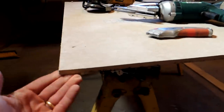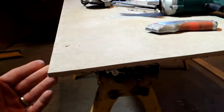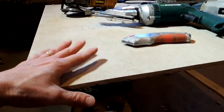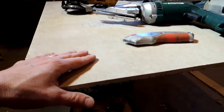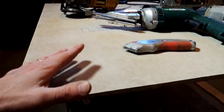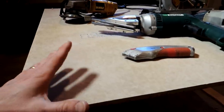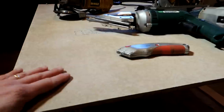Hardy Backer in this form is sold as half-inch — it's actually about five-sixteenths of an inch. But if you're putting up a shower or a tub, you're going to put this on the wall so you can tile over it. If you're doing a floor or something like that, you may be using a quarter-inch Hardy Backer, and that's a little easier to cut. But either way, it takes some doing and some knowledge.